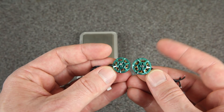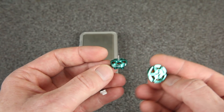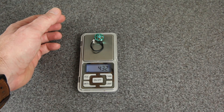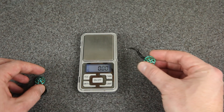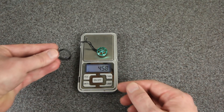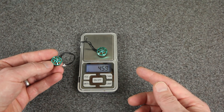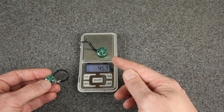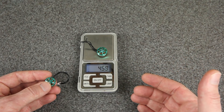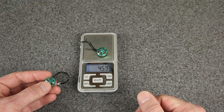On the FPV Cycle website it says the final version of this motor is only 0.2 grams heavier. The original 1202.5 motor is 4.3 grams, and my sample 1302 is 4.6 grams — though the wires aren't exactly the same and this one has a little plug, so take that into account. They are similar, this one is heavier, but I think that works out fine. The added power of the larger motor definitely helps manage the additional load of the HD system I'm carrying, so this is definitely a step up in performance.